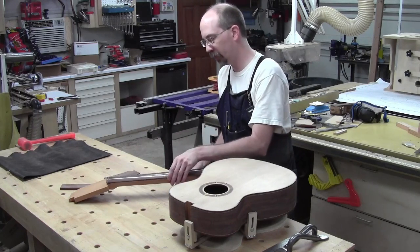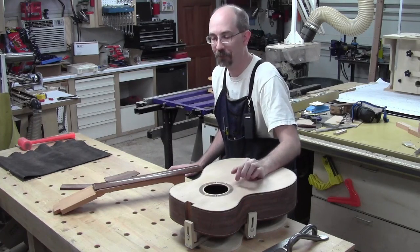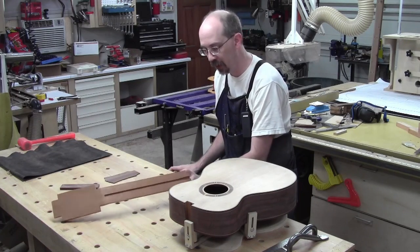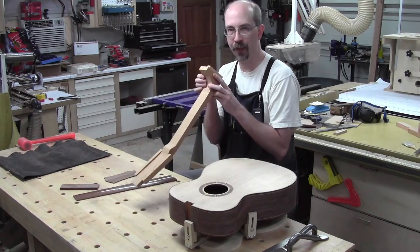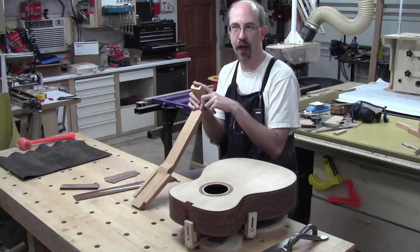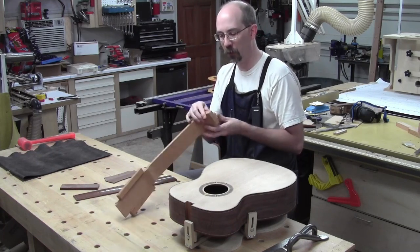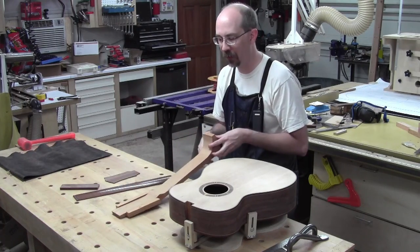While I was watching a lot of those Blues Creek Guitars videos, he was setting the neck when it wasn't necessarily a finished neck, but it could be a finished neck. But it was definitely not in rough block form. He didn't set it in this form. He set it when the heel was shaped either final or very, very close to final, which makes sense because then you're taking less wood away and you're not fighting for a close seam on stock that's going away. So the idea is to get it as close to final as you can, I think.